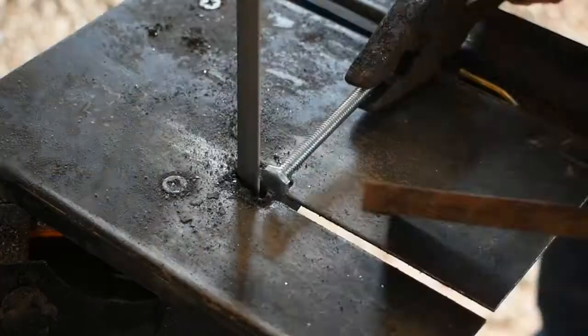This is the bolt we're going to use to affix the pommel and lower guard on this sword. We're going to take it over to the bandsaw and cut the head off, then put it in the forge and flatten out this end so we can mate it up with our tang and give it a pin so it can still pivot and everything can line up once we start tightening it together. Let's get this cut off and get on with the next step.